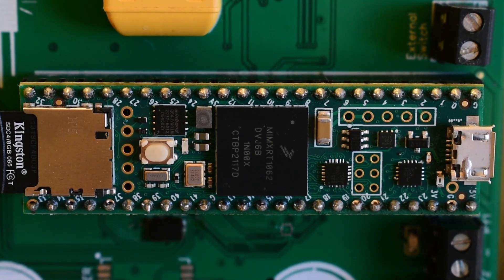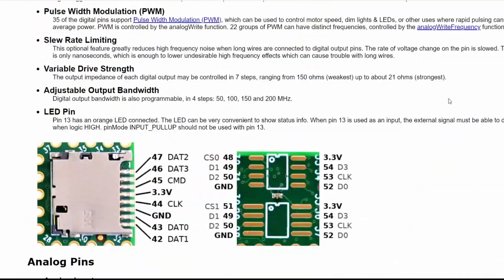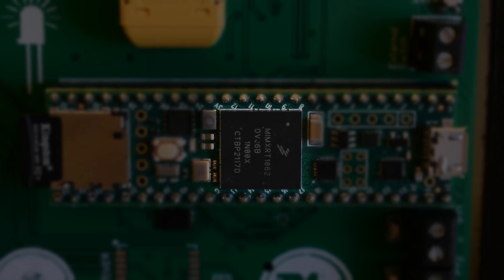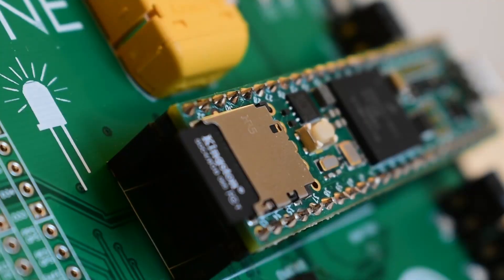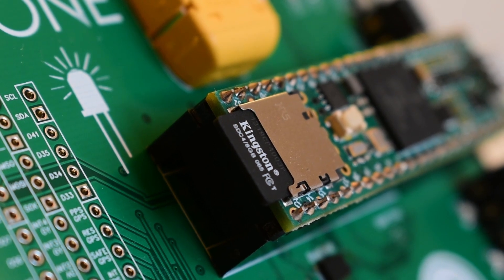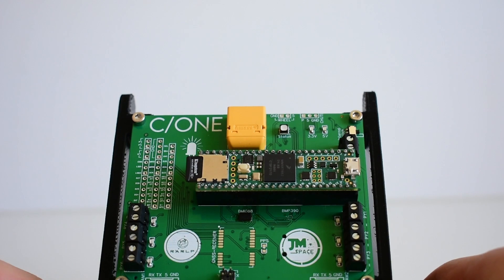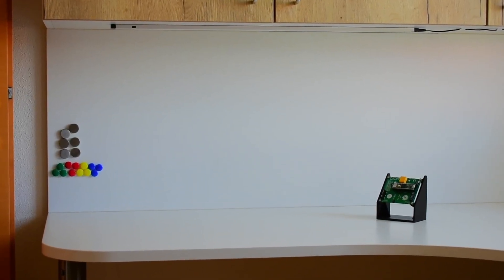The brain of this PCB is the microcontroller Teensy 4.1. This microcontroller developed by PJRC is a beast — it uses an ARM Cortex M7 processor at 600 megahertz, and it houses a lot of GPIO pins. Additionally, it has an internal SD card on which we can save all the flight data without further effort. This powerhouse is able to run our code around 1000 times per second, which is more than enough for our usage here.